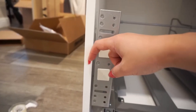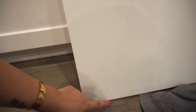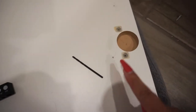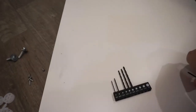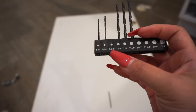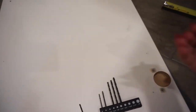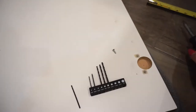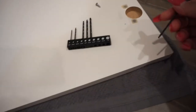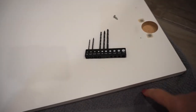I finally was able to mark all my holes. Make sure you have one of these little tools — you need a 3/32 drill bit — because just drilling with a nail just wouldn't work since these doors are so thick. Drill the hole in, but make sure you don't go all the way through because it's going to show on the other side.